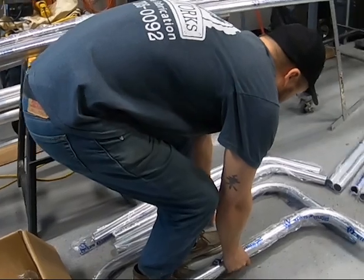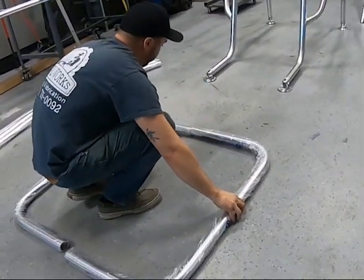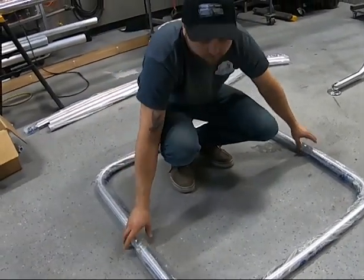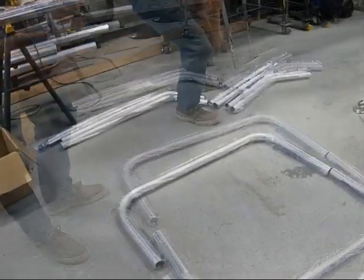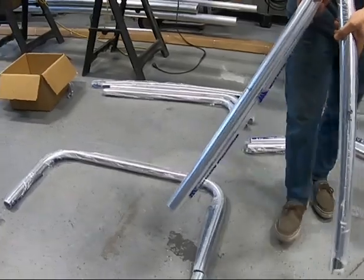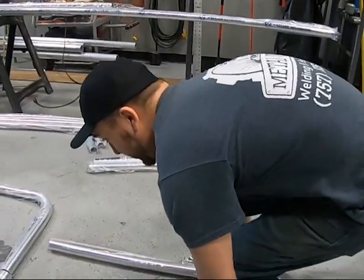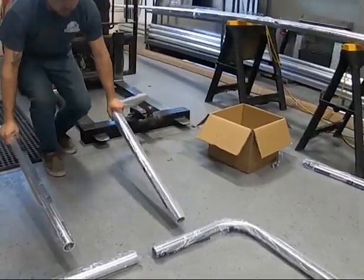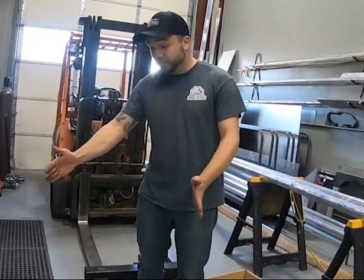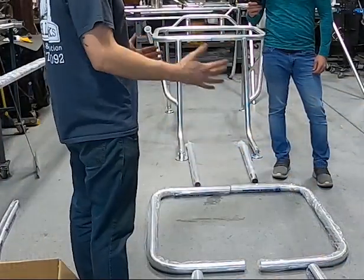When first starting out, I take the main components of the Cobia Tower and lay them out. These pieces are going to be long and will need to be cut so you can decide the width you want your top to be. These are the rear feet — you'd want to notch them. I like to line them up at the back of the tower. The front legs will have roughly a 70-degree angle on them to allow folding. The spread of the feet can be anywhere from 12 inches all the way up to 40 inches at the hoop width, allowing for universal fitment per your boat.